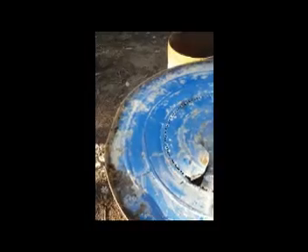Here's the barrel turned upside down. You can see I got some holes cut around the circle here. Now I can get my tool in there and start cutting away with the snips, and then I'll make some radial cuts along there so I can fold the flaps down and tie it into that barrel.